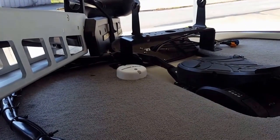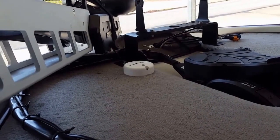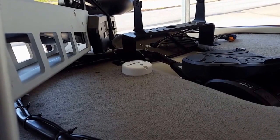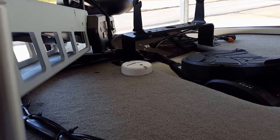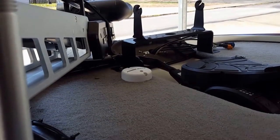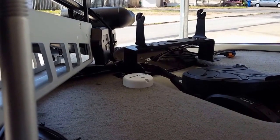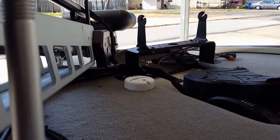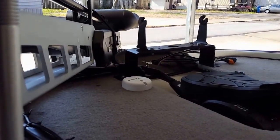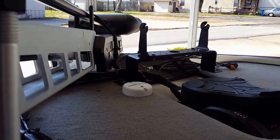And then there's your heading sensor. As you can see, the heading sensor, that was the only place that I could find, using a compass, that didn't have a magnetic draw. Now, the magnetic draw that everybody talks about mainly is coming from the trolling motor magnets themselves in the lower unit down there. And pretty much, you almost can't find any place up here in the bow to put that. To be safe, you probably should put it farther back or on the console or something. I don't like doing that. So I went ahead and decided to put mine up front. It had a little interference, but not really that much. I've used a hand control, and it seems to all just work fine.